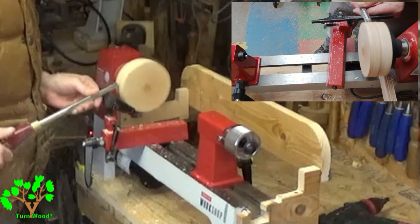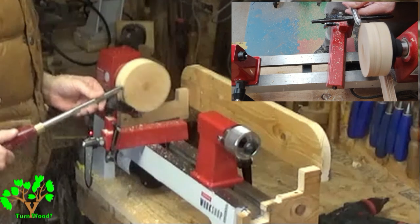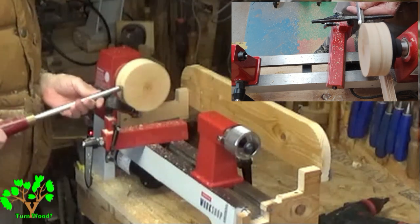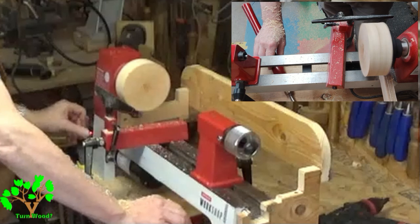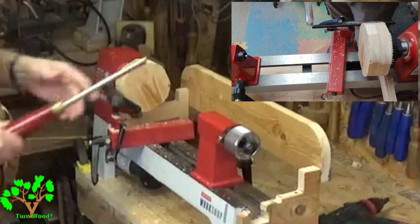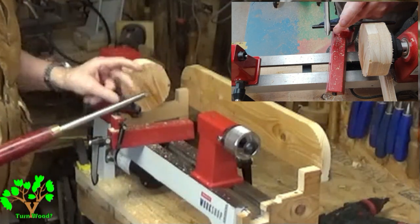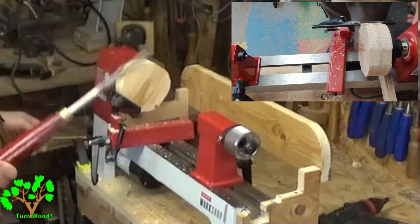If you remember from the first lesson, I made a sweet spot, and that same applies to the bowl gouge as well. Now as we're going down in diameter, the gap between the tool rest and the edge of the bowl gouge is quite wide now. So we'll stop the lathe and bring it further up. The farther out you are, the more loading there is, and the easier it is for the blade to tip. So the less distance we have between the edge of the tool and the tool post, the better.